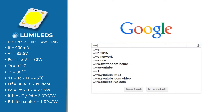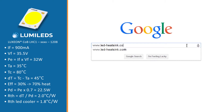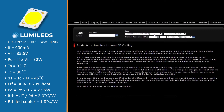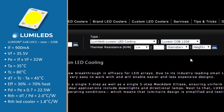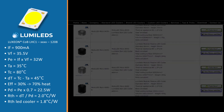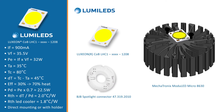The value we have now calculated will help us find an LED cooler which is also mechanically compatible. For that we go to our website led-heatsink.com. First we select the Philips Lumileds section, then in the search parameters we select the 1208 chip-on-board module, fill in 1.8 degrees Celsius per watt thermal resistance, and click go. The results that appear are all thermally and mechanically compatible — you can mount the chip-on-board module directly on the LED cooler or by use of a Zhaga Book 3 LED holder.